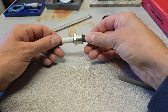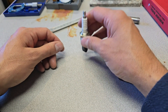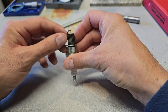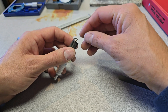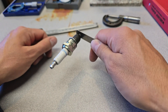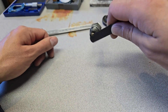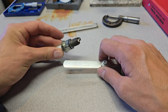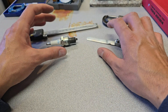If you have a gap that's too big, you need to close it. There's a little tool you can tap the electrode with, or tap it gently on a solid surface to close it up until you've reached your desired gap. If you go too far, you bend the electrode out a bit. An accurate gap will hold onto the feeler gauge no matter what you do with it. Now that you understand how a feeler gauge should feel and how to set a spark plug gap accurately, let's bring in valve gap adjustment — something a novice Mini owner might have to deal with.